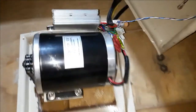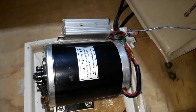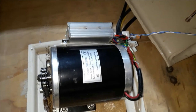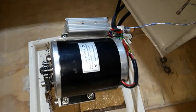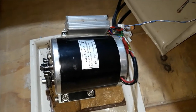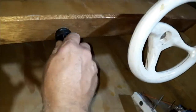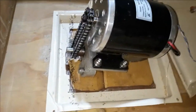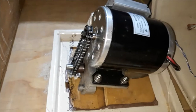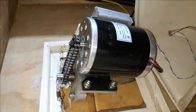This is the 500 watt 24 volt unit running lead acid batteries. The faster boat you might have seen is a 2000 watt, 60 volt unit, and I had a series of lithium batteries in that in a battery pack I've made. Key switch here. The chain drive system works well — we've had zero problems with it. It's a little bit noisy though, so we're going to put a belt drive system in the newer one. That gear's all downstairs ready to go.